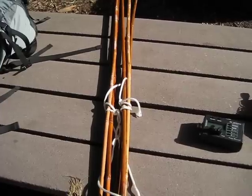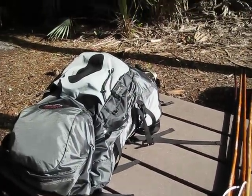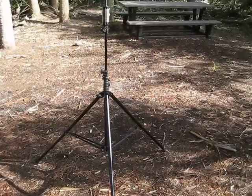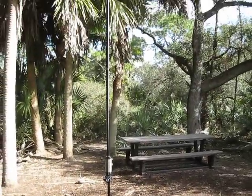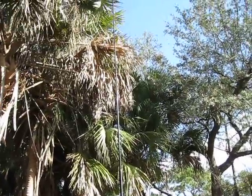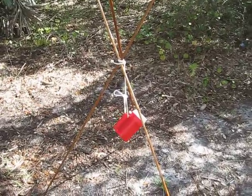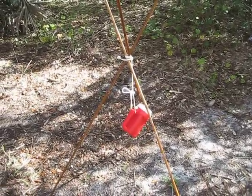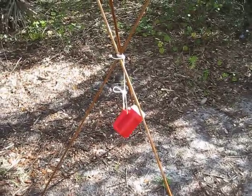These don't weigh very much, they're not very sturdy, so I need something to balance them. And then it all comes in a nice little backpack. Here's the setup for the vertical — I've got the coil in there and then I've got as much as I can put up out there. This is going to hold my counterpoise here. Not real strong, but I put a little weight on it to keep it a little bit sturdier.